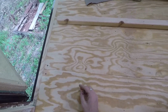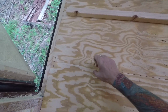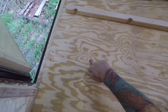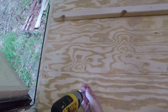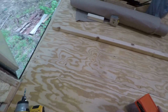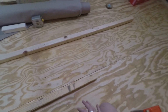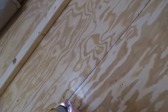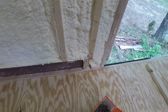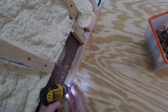Making sure they're flush, and I'm trying to screw them not next to the previous piece's screws, for structural reasons, because then you have 2 screws splitting the subfloor down, and the framing, they're next to each other, kind of weaken it. Might not be really necessary, doesn't probably matter, but I'm offsetting them. And you can even have a little piece of wood here too, so you can put them the same distance. And now we got that middle of the subfloor piece where I drew the line.